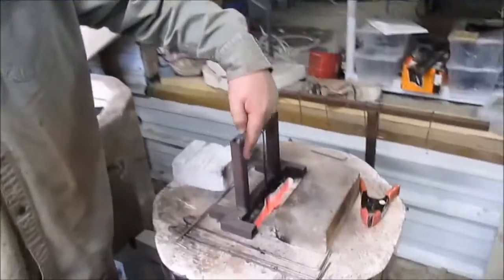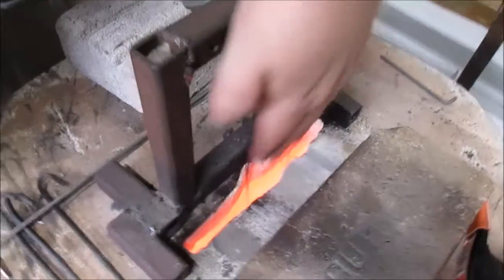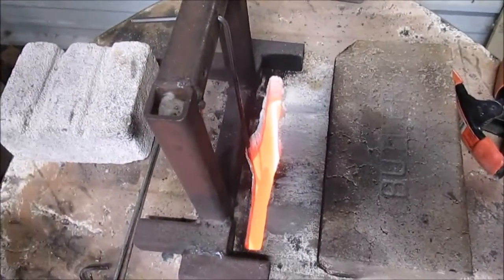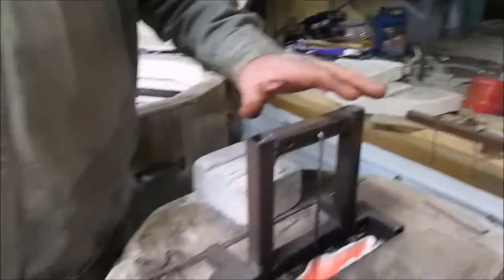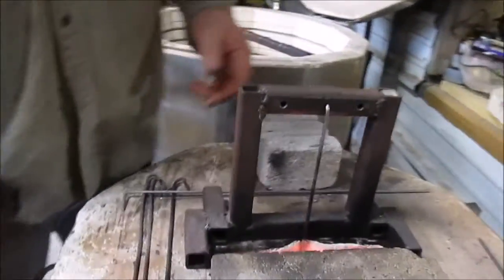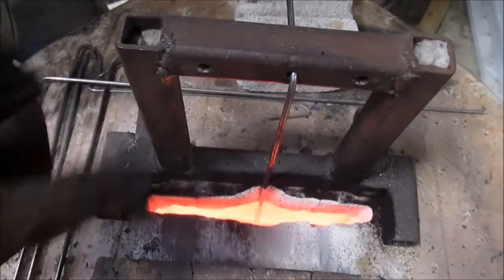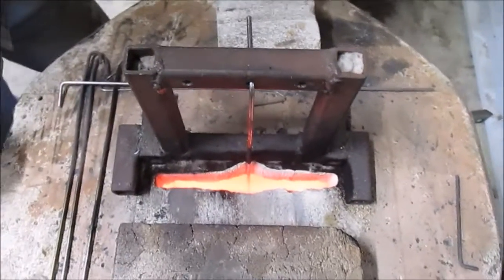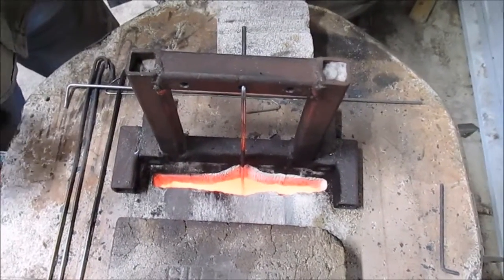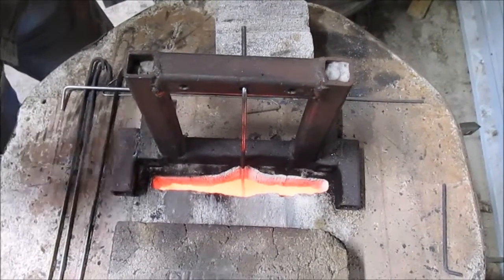And this is actually a lid off of an old kiln. It had a hole in the top and I extended it into a slot that is long enough for the tomahawks to fit in, and then we built this hanger and we suspend the tomahawk blanks down in on a stainless steel large gauge welding rod. The stainless holds its strength more than carbon steel does whenever it's hot, and it doesn't scale up, so it lasts for a long time.